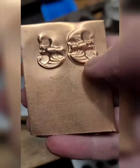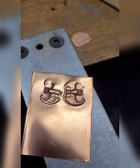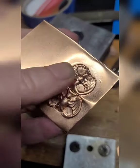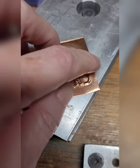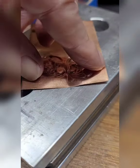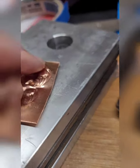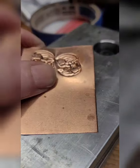I'm going to continue doing this. I was able to get close, so I'm going to do some more. I decided to go back in and finish pressing these a little bit more. Notice how the metal has moved, so as I'm pressing one, the other side pops up — that's what allows you to do this. Because if it didn't, the second impression would smush into the first one. By moving, the metal will allow you to do this.